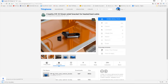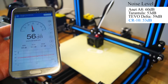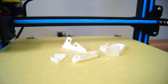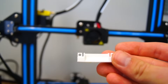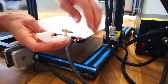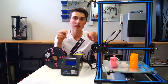I downloaded a few upgrades from Thingiverse, sliced the objects in Cura, and started the first print. I was blown away by the incredible quality of each layer. I still decided to print a fan nozzle that will direct the airflow towards the plastic rather than the hardened nozzle. The one upgrade I highly recommend is the strain relief bracket for the heat bed connections — links in the description below.